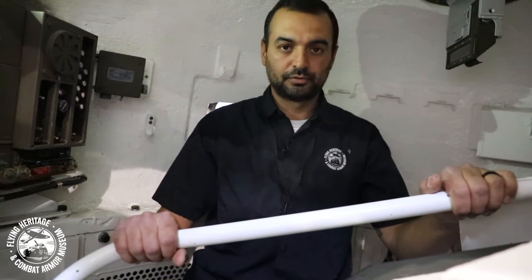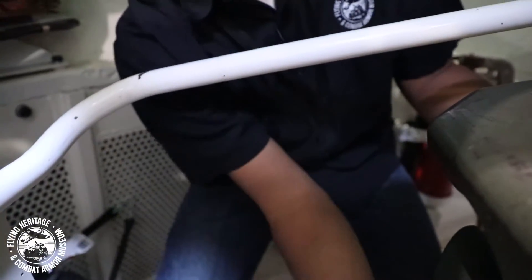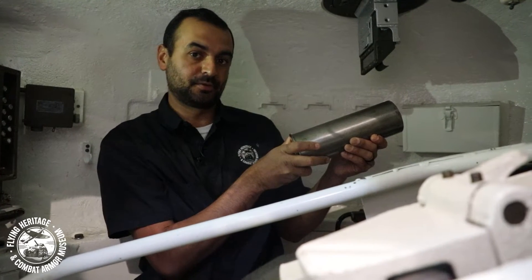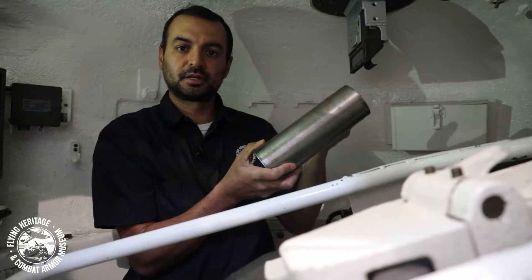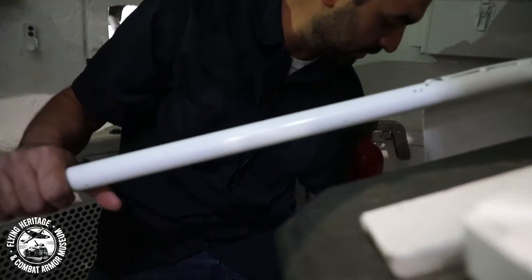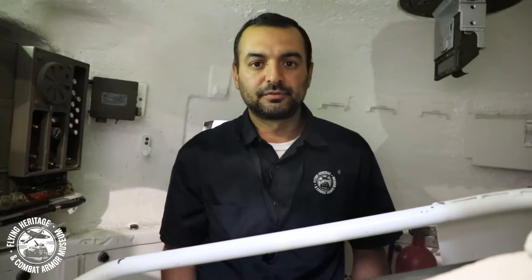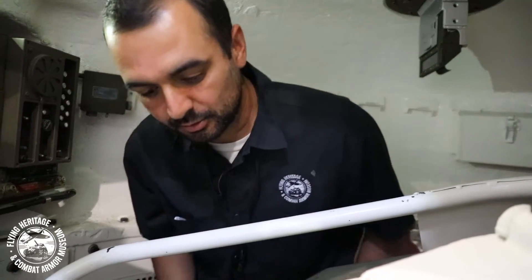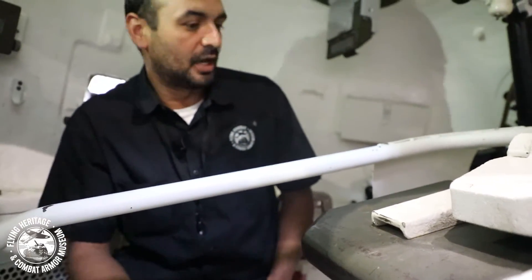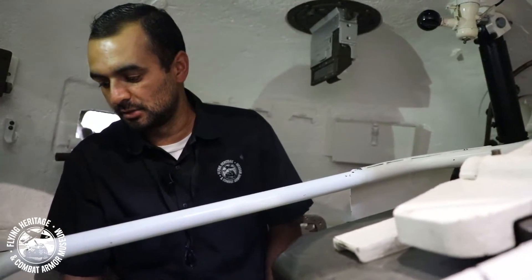You're ready to go, you go for the ride, then you fire and push the handle back out. The shell comes out — you want to keep it always pointed away from you for safety, because of the gunpowder it's smoking and there might still be a red ember in there. Give it a second, then slowly put it back to the bottom. If you're firing more than one shot, quickly make sure you don't see any red in there or any smoke after it's cleared, because you don't want that ember to accidentally light off the next round.